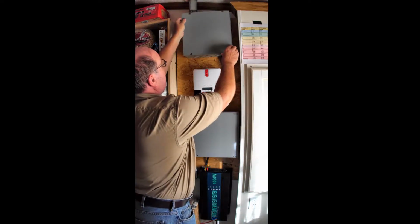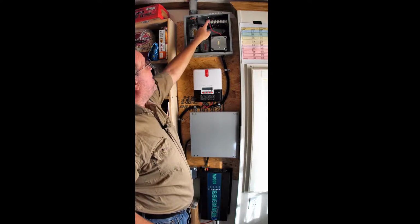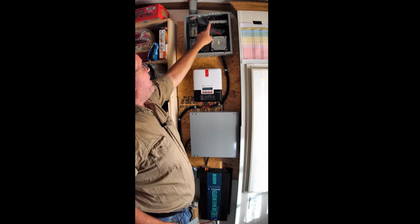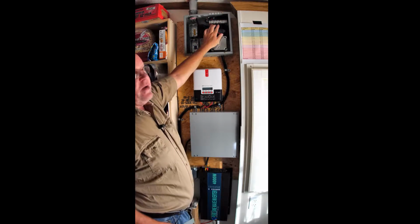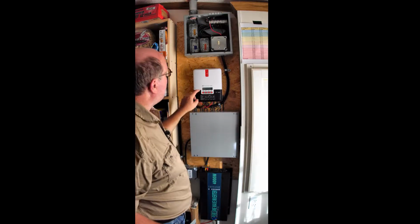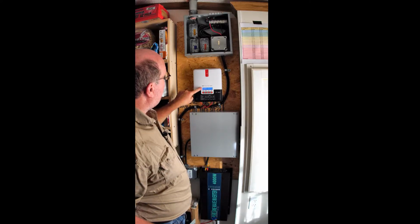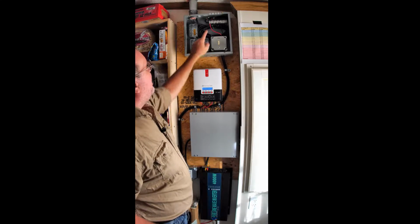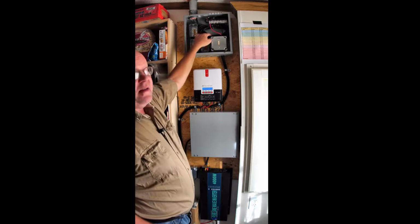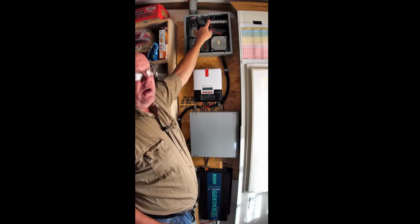Now this is my low voltage side. All the solar panels come in here and they are terminated on the top of this terminal strip. Down here is where I put jumpers in, so they're in series. I've got 4 panels. They each are capable of putting out about 20 volts. And actually it's putting out 79.8, 79.7 volts right now because I have them in series. The reason I did it here is because not only do the cables reach down into here, but I wanted to be able to do some switching here if I wanted to.